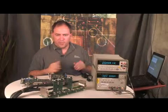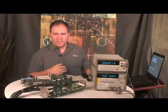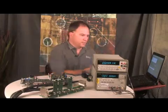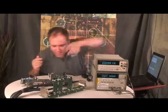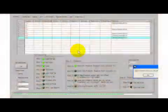After they're turned on, there's a soak period where you can apply power to each one of the sensor modules for as long as you need so that the sensor module can fully stabilize. This is an adjustable time period. I'm going to adjust the pressure switch to minimum pressure and continue the calibration.